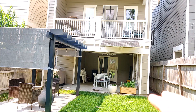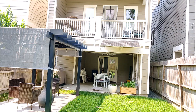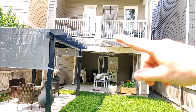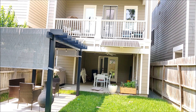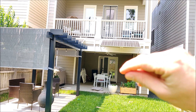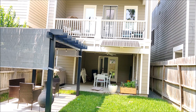You don't need to put panels on your roof or find a fancy mounting solution for hobby use. These panels just have three door hinges pop-riveted onto the frame and they're hung on a wooden frame I screwed into my siding. They have two prop arms that let them collapse — if a hurricane is coming I can lower them down so they fold flush against the side of my house. A shed, carport, or pergola are all great places to put a couple of panels.